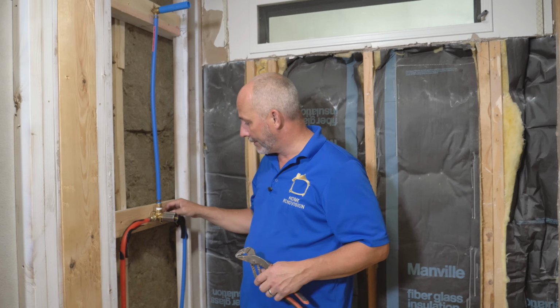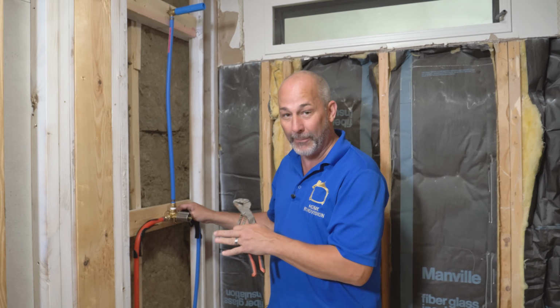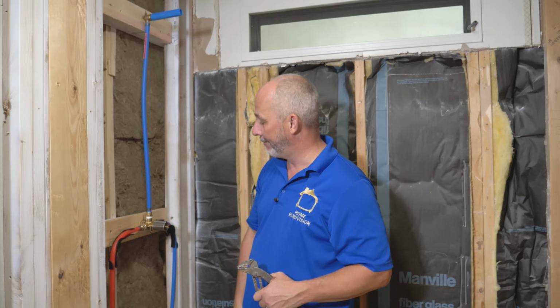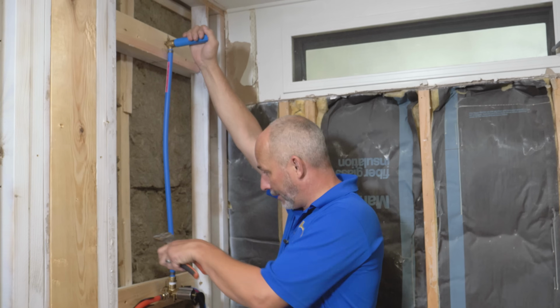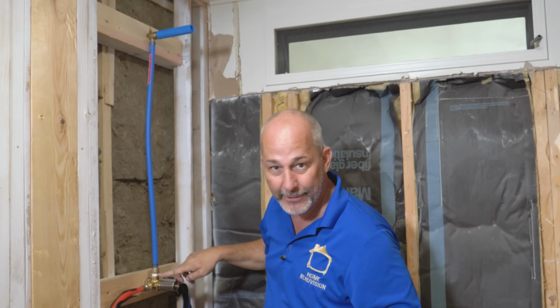Like I said, a lot of the times these leaks will develop over 24 or 48 hours. So don't be in a hurry to close if you're doing this project on your own. Give it a couple of days to confirm that everything is fine. Get this little stopper. Make sure that this line is pressurized as well, so you can check your fittings and your connections. That way when you do close, you can close with confidence, knowing that you're not going to develop a water problem down the road.